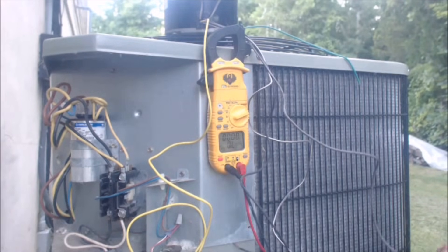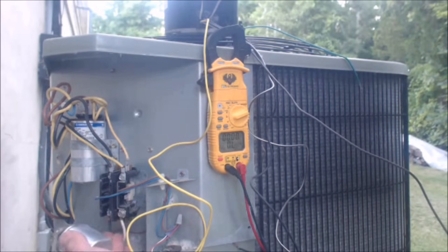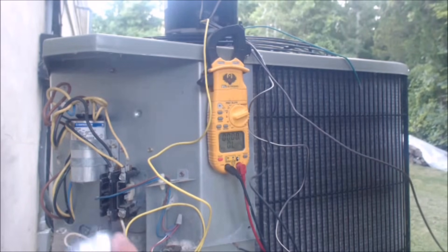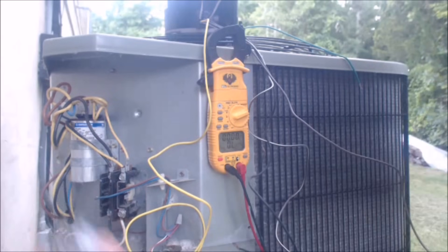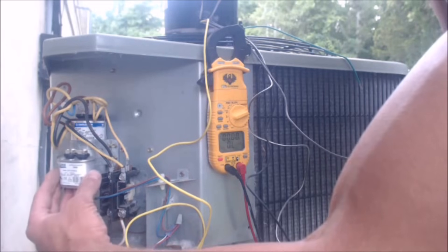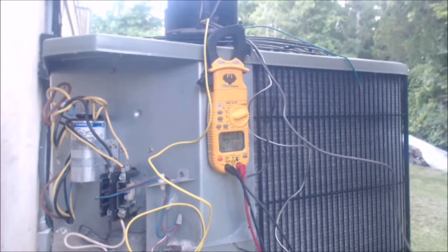You should not ever really need two capacitors inside a condensing unit. Just so you know, the 240 volts is off right now — the 24 volts is calling because you can see the plunger pulled down on the contactor. You should never see two capacitors unless you have a run capacitor and a start capacitor — start capacitors are usually black. The main time you'd need two separate capacitors is if you don't have the correct size dual run capacitor. I hope this helps — I'll see you next time at AC Service Tech channel.